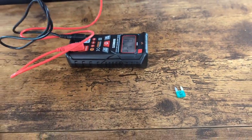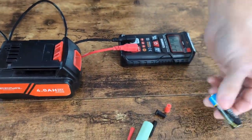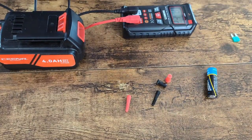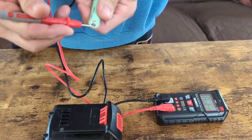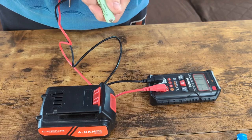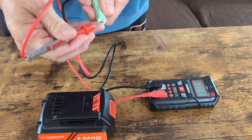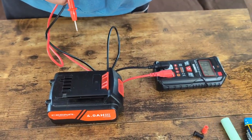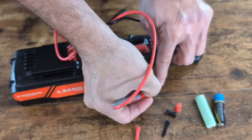So we're going to check something else. Like I said, if you're not sure what to put it in, put it in auto. We checked the DC voltage on the good battery — we got 1.57. We checked the voltage on the bad one — we're not getting anything from it, it doesn't even read. We got about 0.3 and then it goes back to auto. So we know that one's not good. We know this fuse is good — it goes to ohms and makes a beep sound to tell us we're good.